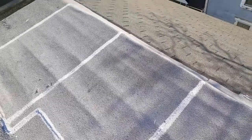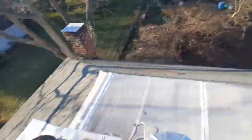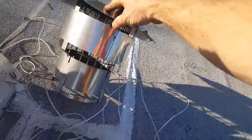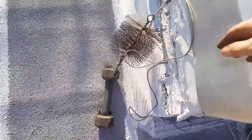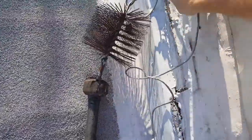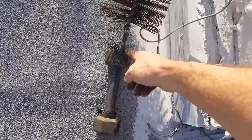I'm back here, up on my roof in Mechanicsburg. I've already taken the top off the flue, and what I have here is this chimney sweep brush. There are a couple of ways you can do it — you can add rods to it, fiberglass rods, like a big stick, and poke it down.